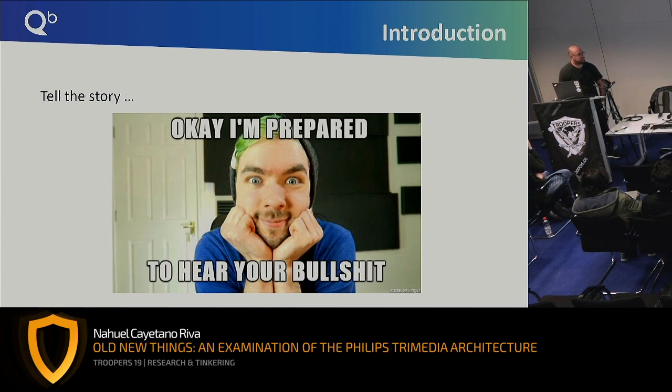Okay, this research started last year. Basically, some years ago, with a former coworker, we did a presentation at Hacklu in Luxembourg about how to hack different models and brands of IP cameras. We found a lot of vulnerabilities in these cameras, remote vulnerabilities, remote code execution, and we could hack all of them. And the interesting thing about these cameras was that all of them were ARM or MIPS-based. Since then, I was collecting a lot of cameras, different models and brands, and all of them also have ARM and MIPS. But last year, I bought one, the Link camera, that was different to all the others I found in the past, and that's the camera that has the TriMedia CPU.